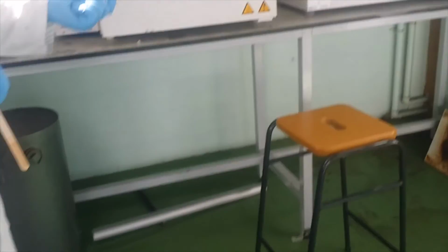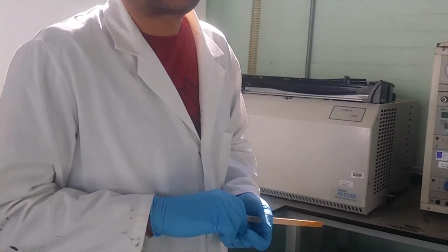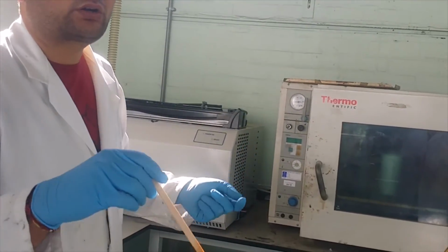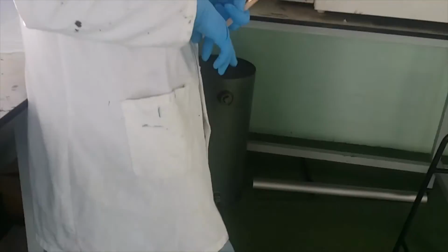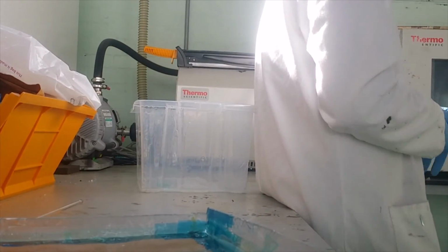The oven was already at high temperature. If the temperature is high, it will degas quickly, but it will start the reaction. So it is caused either by a long delay between mixing and infusion, or because they heated the resin and hardener before the infusion.